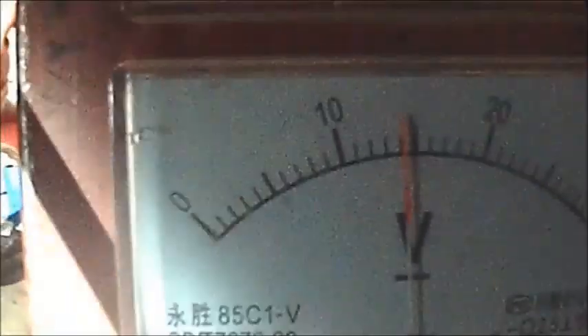I'll turn this voltage switch on, and now you can see the voltage here — it's almost at 15 volts also. These wires up here are coming in on three 14-gauge wires, using all three wires each time for each leg. Then it comes out and hits a 10-gauge wire and goes right straight into the machine. You can see the fan is running, the rectifier is very warm and running.